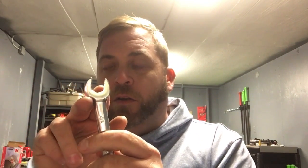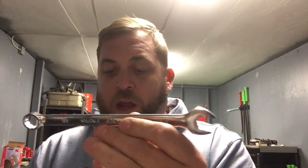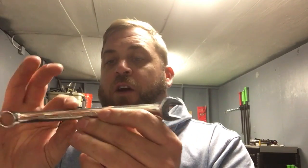It weighs 92 grams. The head opening in here is 506 thousandths, and the head thickness is 257. The head width is an inch 050, basically 049. The beam thickness is 287. And the width is almost 500 thousandths, 497 to be exact.